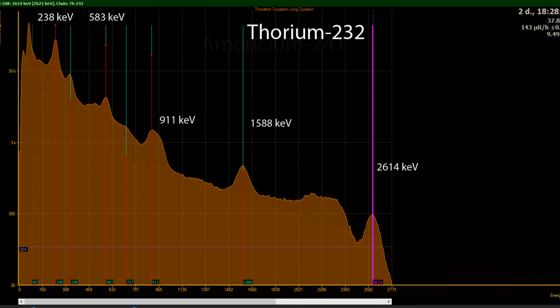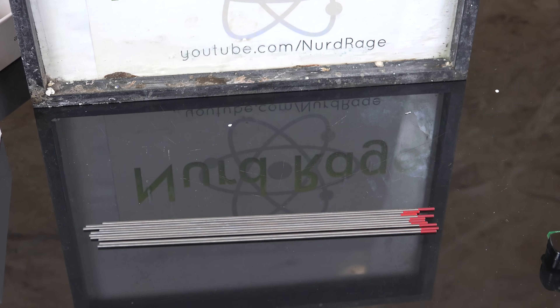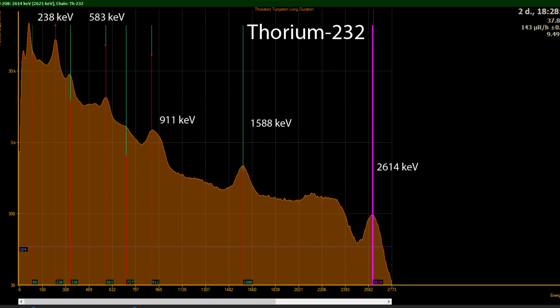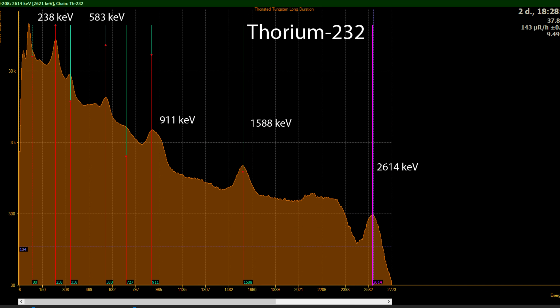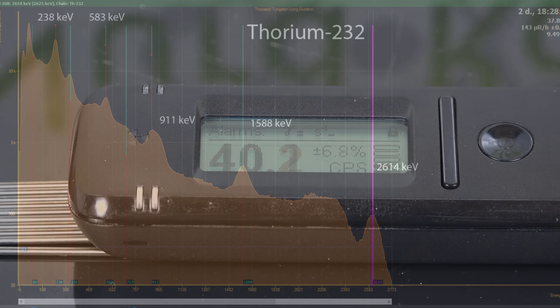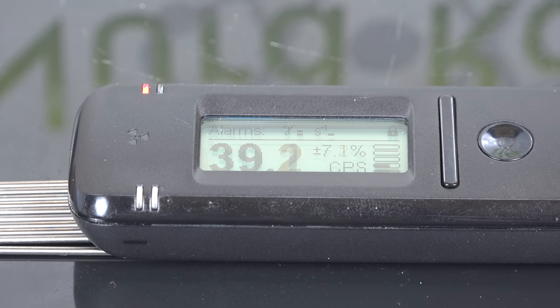It's not a problem but is annoying to keep doing. To calibrate it, my favorite gamma source is the thoriated tungsten rods. They have several gamma peaks and this makes them very useful for calibration across the energy range, as I can use them for both low energy and high energy ranges. But what I don't like about them is that the signal is not that strong, so I need to collect a spectrum over several hours, even days, to get a nice clean spectrum. I'd like a strongly radioactive source for calibration purposes — of course not too strong; I'm not going to collect Chernobyl corium for obvious reasons — but I would like something stronger than this.